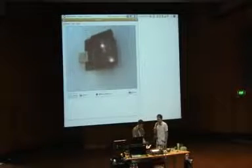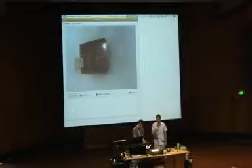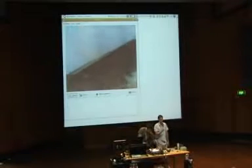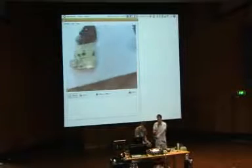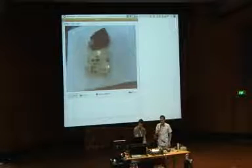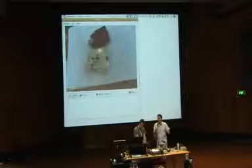You can't exactly use proper compliant HTML and CSS and all that sort of stuff because you just don't have room for it. But if you want to implement some very basic TCP/IP connectivity, this is pretty cool. You can do things like set up very simple web services where you want to check the value of, say, a temperature sensor that might be connected to one of these boards. You could run a little piece of software in it which basically provides an HTTP server, and when you connect to it, it responds with a page that includes the value of the temperature sensor.